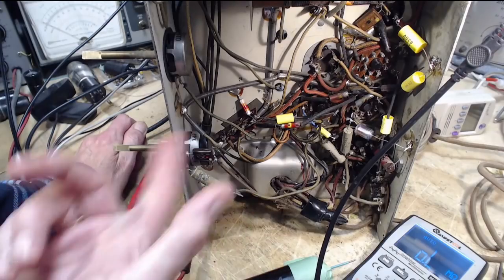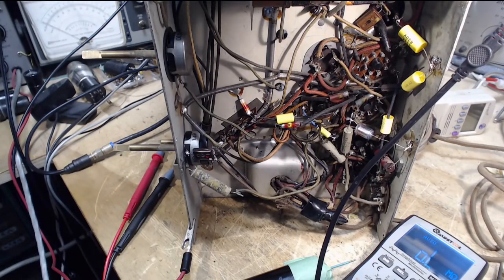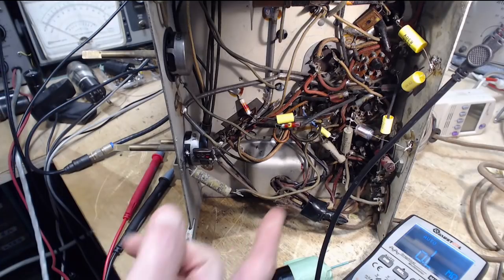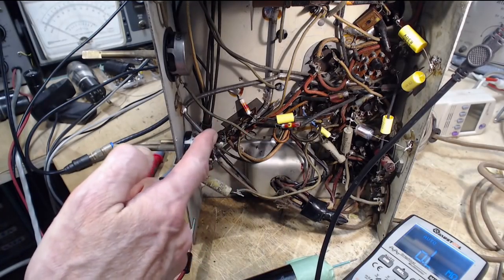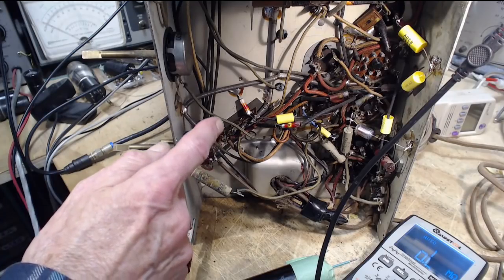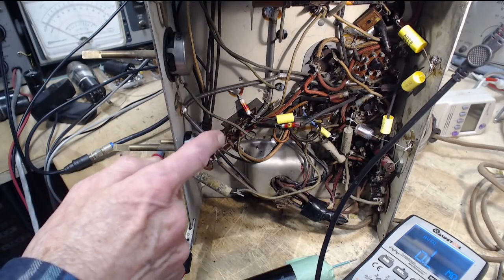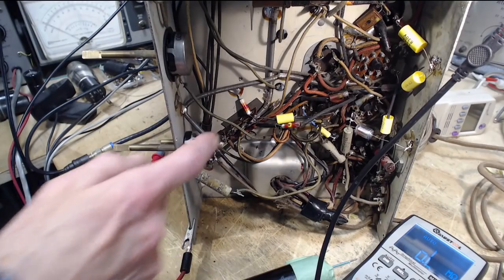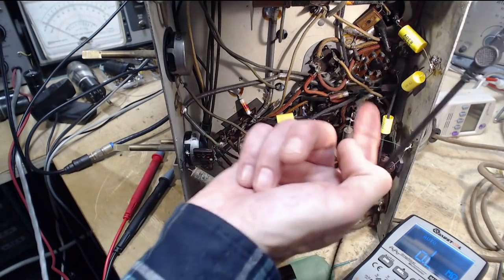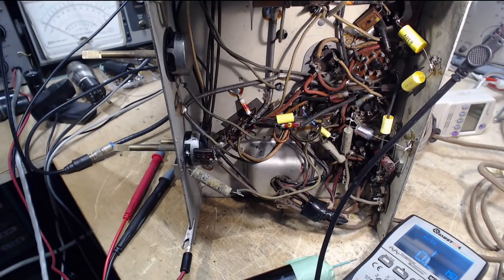So my move here is just to change this all around until it matches the schematic. And we know this is the wire coming. Let's check the schematic on this. This is the wire coming to the control. Why would you have one shielded wire coming all the way to the control, and then a wire leaving it non-shielded? Because saying it's going away from there is not right.